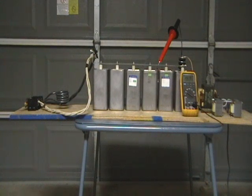What I've got is six high voltage capacitors. We've got a step-up transformer out of a microwave oven. I've rectified the voltage so it charges them up to a DC voltage — it's going to be about 3000 volts DC, instantaneously discharged through the two brass doorknobs.